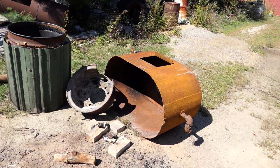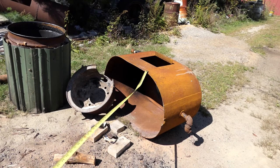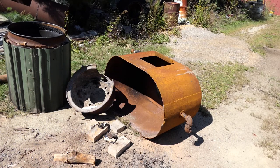That sits on a couple of fire bricks, which just raises it up. You just keep jamming wood in there until the pyrolysis event is over with, and then you let her cool down. It's a 24-hour process as far as I'm concerned — I let it set overnight. It keeps all the flames inside of this tub, this cut-off barrel. All the flames stay right inside of it very nicely, but it is some kind of hot all around it — probably an 8-foot area that you don't want anything combustible around, because that gets mighty hot. But everything's contained.